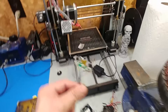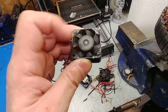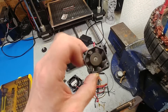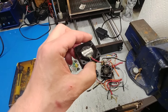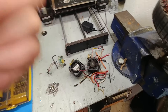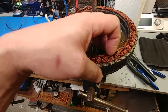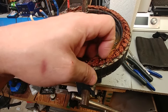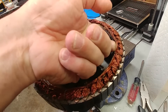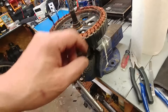I managed to get the housing off in one piece - a bit of glue on there. Surprisingly, these fans actually survived all those years. The sealed bearings are a little rough though - you can feel it when you spin it, this one doesn't spin very well. I managed to put glue in there and I guess it was enough to keep the water out. You can see the difference between the newer ones and this older one - this older one has little pieces of string all the way through it tying all the windings down, which they all should have.